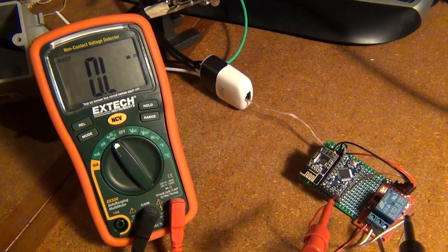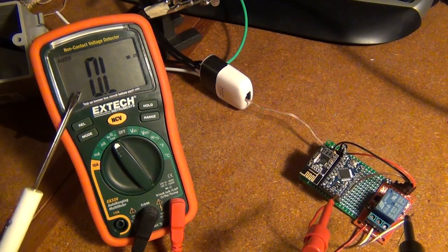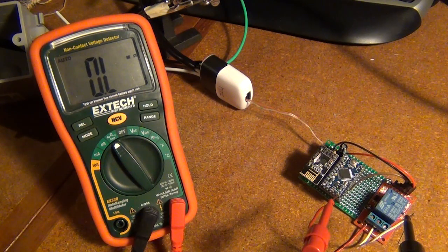The relay, these two connections over here, is basically off when it's first powered, or in this state. When it's powered off, it's set to off, as you can see from here. When there's a connection all the way through, you'll see 4 zeros. So that's what I want it to be, off right now. And when I plug it in, I want it to be off as well when the Arduino is first starting up. Then I can turn it on if I want to.